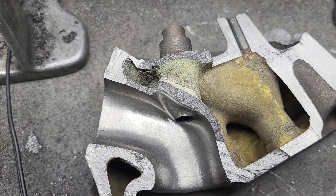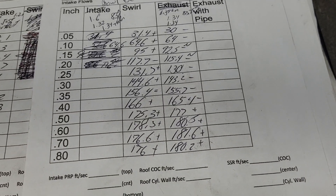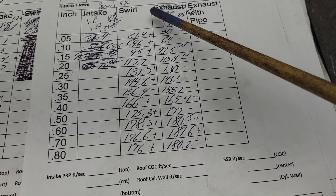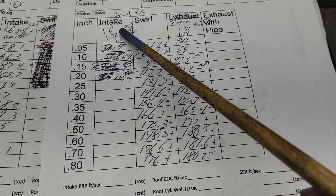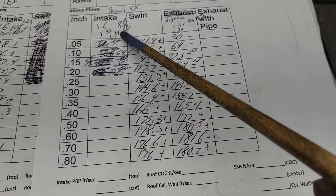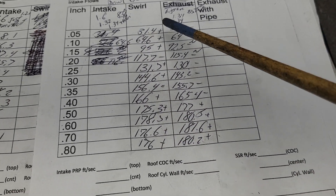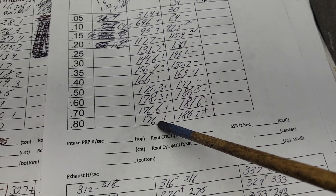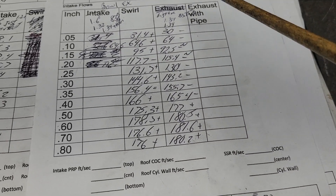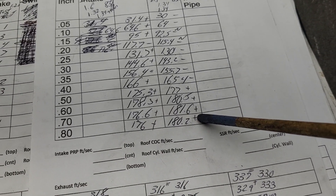Let's see if this last cut was a winner or a loser. All we did was we evened up our throat, so it's not an offset throat. Nothing wrong with having an offset throat — in fact, sometimes you can get much better results with an offset throat. But we're taking this last one and we just evened up that throat. Results: loser, loser, noisy, loser, loser, winner, winner, winner.